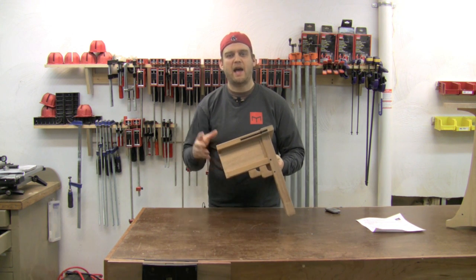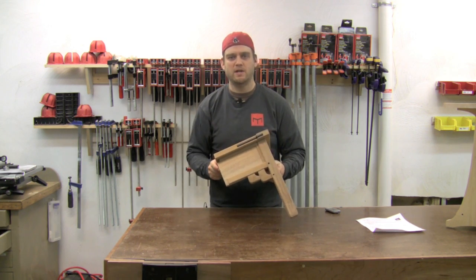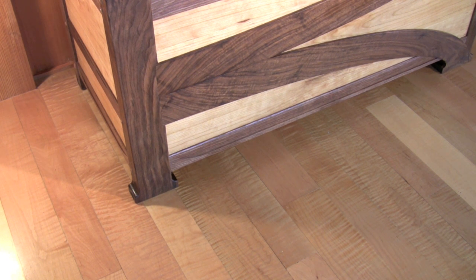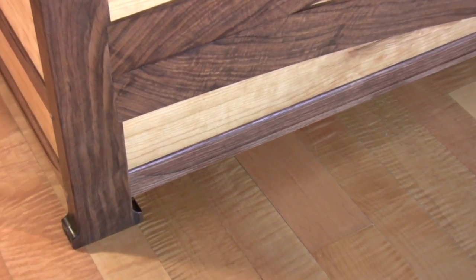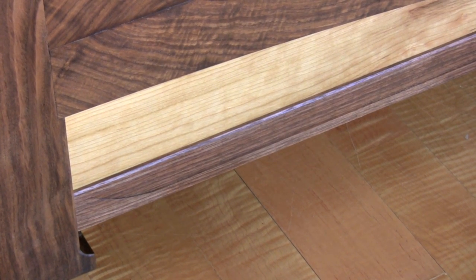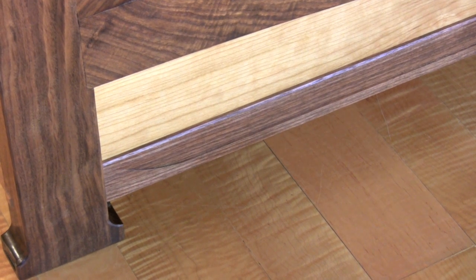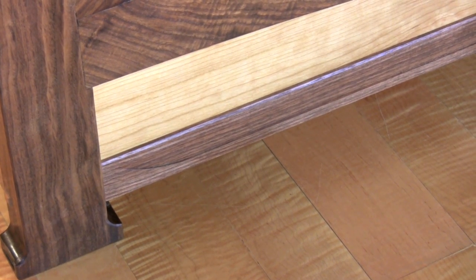Let's see how those details influenced what I did on the toy chest. This curved indent detail is used in a variety of places throughout the chest, and it really came as a stylized version of a cloud lift. It's here at the bottom, just helping to define that rail and make it a little more interesting — it starts near the stile, just like a cloud lift, and then runs all the way along.